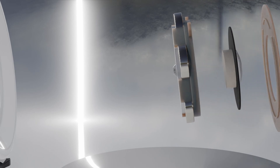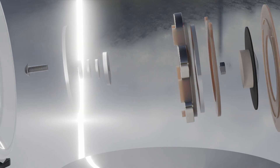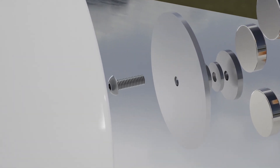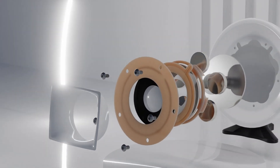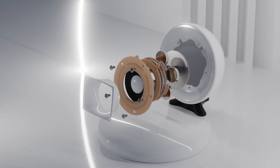The motor plates are made of mild steel and the magnets are N52. The enclosure is a simple sealed shape with rounded interior walls to reduce standing waves, though no waves should be able to escape the back side due to the nature of the driver's construction. The horn on the front helps direct waves, though no math was done to predict its exact operation.